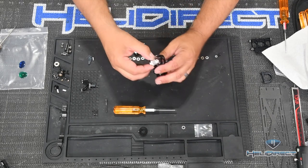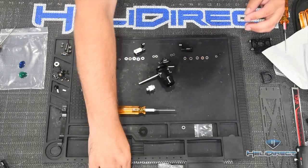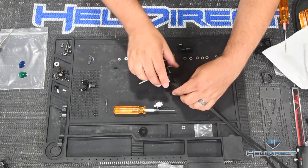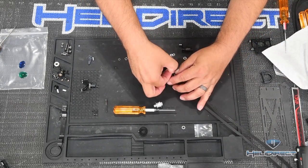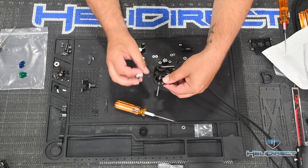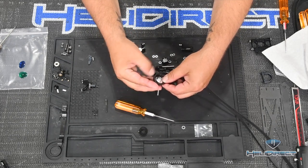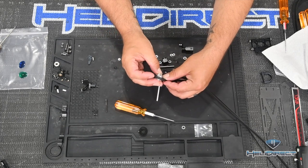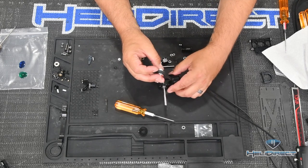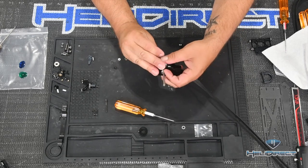on this other side. Now, right here is where I almost caught myself again and forgot to install our tail belt. So we're going to go ahead and get that in here as well. We'll just feed that through the tail box, lift it up like so, and then we'll take our tail pulley. There's our end with the hole for the set screw right here. And then slide it into the tail box.